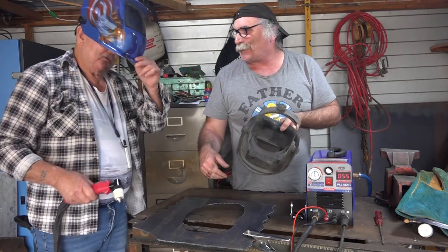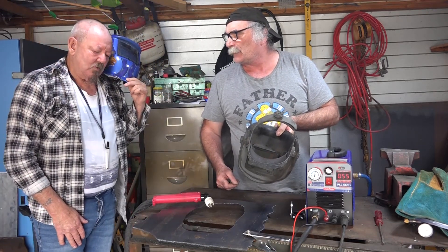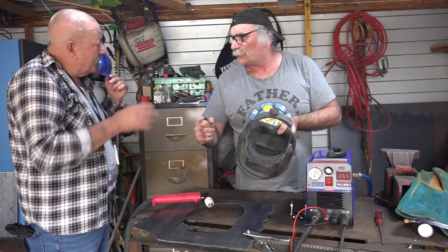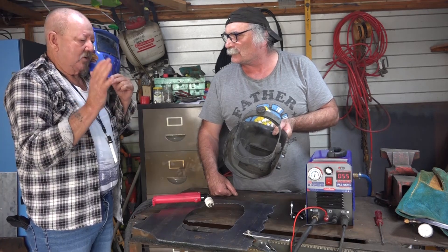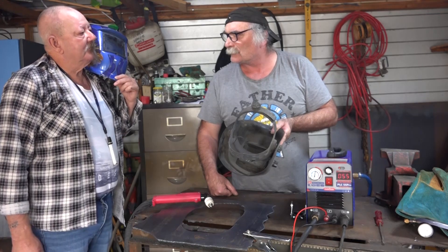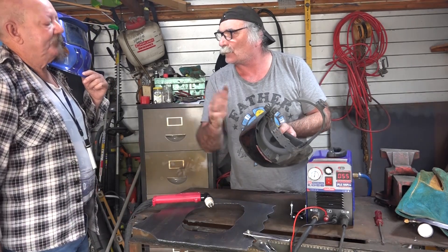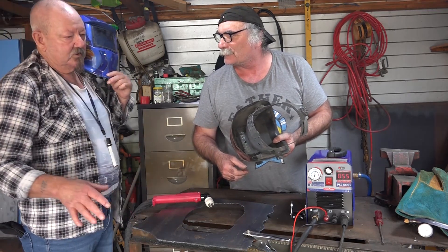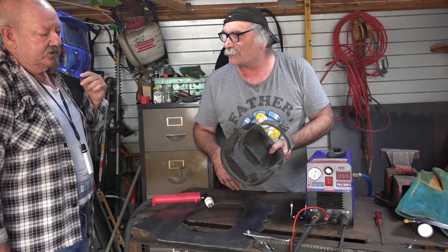You're getting the hang of it now - third cut. It's certainly a lot better than an angle grinder. How are you normally cutting your steel, Barry? Some on the small grinders, and the cold saw to cut box section, getting the 45s on it. You wouldn't want to use something like this to cut 45s on box section - you're better off with a mitre saw or cold saw for that. This is designed to cut flat sheet and shapes. On the CNC router it'll be ideal because it holds it steady and gives you a constant speed.